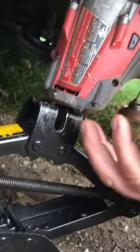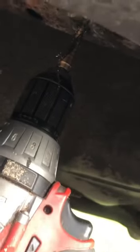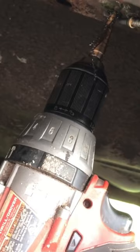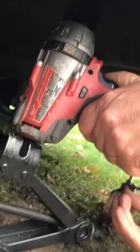So I've got a trick. I'm using this jack to put pressure on the drill, and it just makes all the difference in the world. I can go up here, squirt on a little cutting oil, and now it's kind of like a drill press.